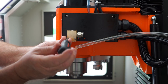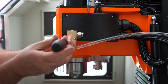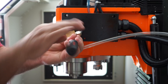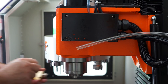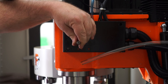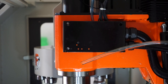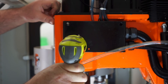Here we are, just removing the block off the machine, removing the hose, and taking it all apart. I'll have to change the position of this block — rotate it 90 degrees. To do that I need to centre punch a new hole, mark that location, centre pop it, and put a pilot drill through. Just a little 2mm pilot drill hole.